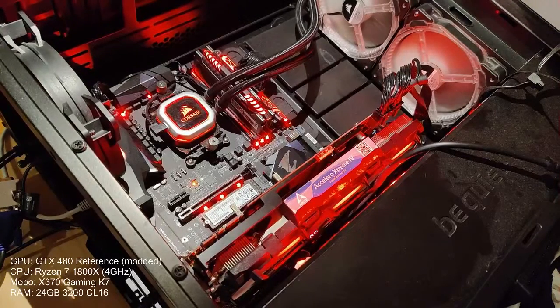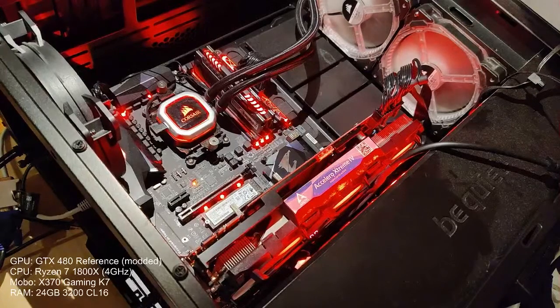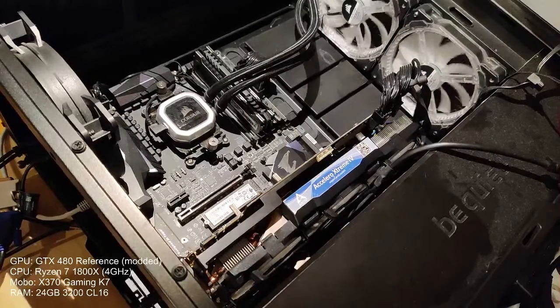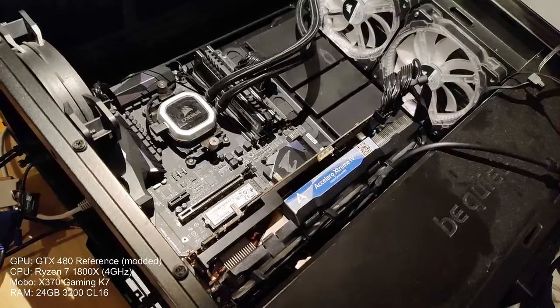But it's harder on cards that do not have that kind of solder points. It's still possible if you find a good connection for 12 volts and ground, and you take some high gauge cables and solder the connector to that. It's gonna work. It would just be janky, and you're gonna need a really, really strong soldering iron for that.